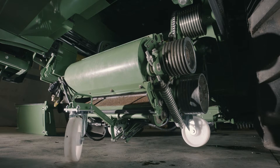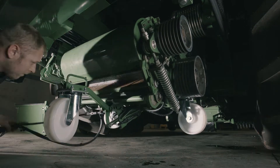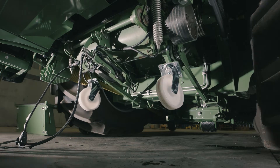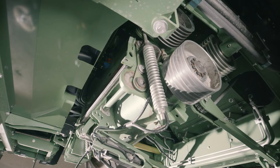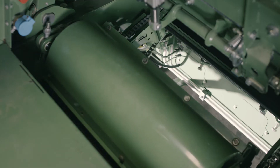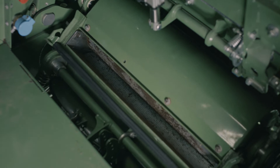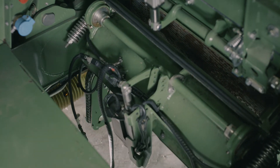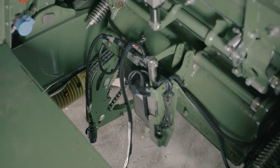Remove the two linchpins, put the clips into place, reattach the linchpins back on which puts it onto the VariQuick system. You then wind it up with either the manual wind handle or the electric option. Wind it all the way up until it's in place, then lock down the two tabs and attach the electric and hydraulic pipes — and that's it installed.